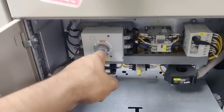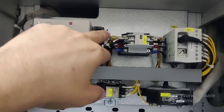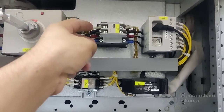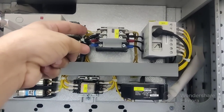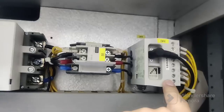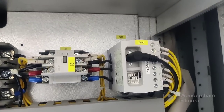I'll show you here the main ABS main breaker, and it has three outgoings. You can see here three outgoings coming to this contactor. Three cables are coming here — this wiring is for the control, but the three main wires are coming here, going outside and crossing this EMPR. As I told you in the previous video, this is the electronic motor protection relay.